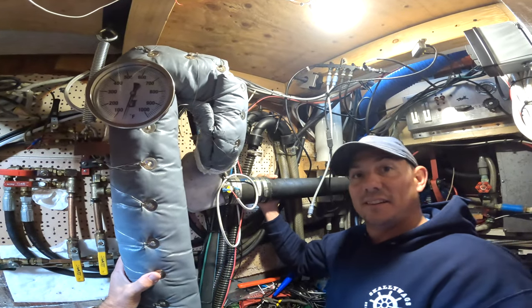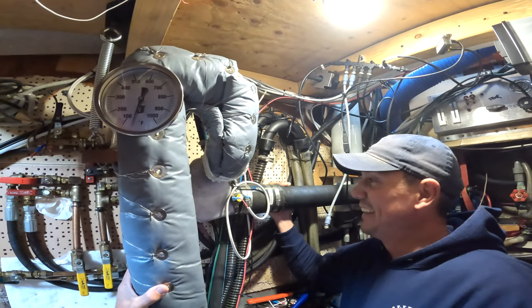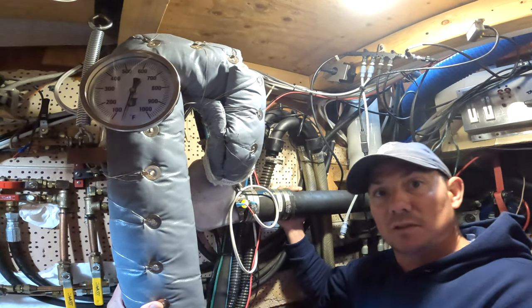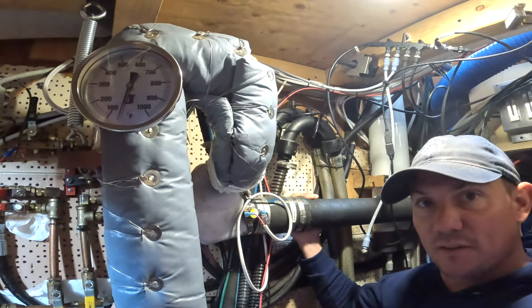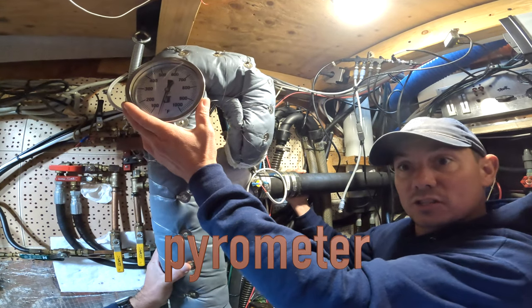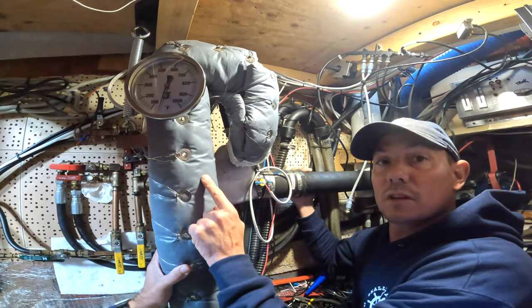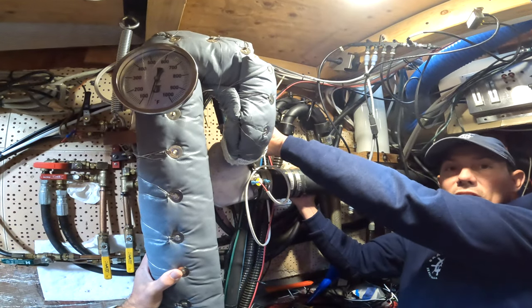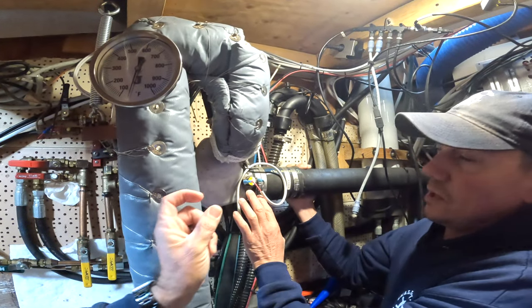Alright Gio, we're down here in this tight little engine space. This is actually a lot more accessible than most exhaust elbows and typical sailboat engines — this is really atypical, but for a pirate ship it's very fitting. So you have a dry stack here coming up with a thermometer. This thermometer is typically at what temperature? Between 600 and 800 degrees. So exhaust is coming up here, goes to your exhaust elbow. You have raw water injecting right here that brings that to below 170 degrees — all in like two inches.